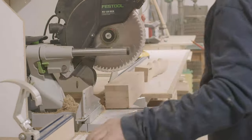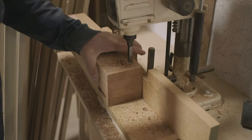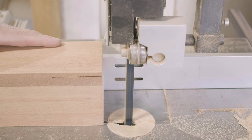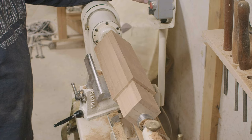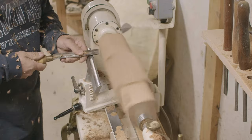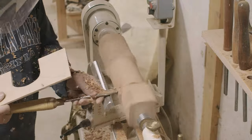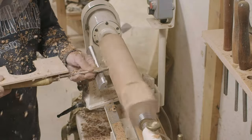After I got all my blanks glued together, I basically made a three and a half by three and a half. The first thing I want to do is put my mortises in there while the stock is square. So I want to put all the mortises in. This is where I'm actually taking and using the bandsaw to narrow up the knee. I'm going to call the square spot on the top of the leg the knee, because I'm actually turning the rest of this leg into a cylinder. So I'm going to lose a lot of that circumference and I want to blend that into the corners of the knee. Here we're just taking down the rest of the leg, turning it into a cylinder and getting ready to start carving our curve.